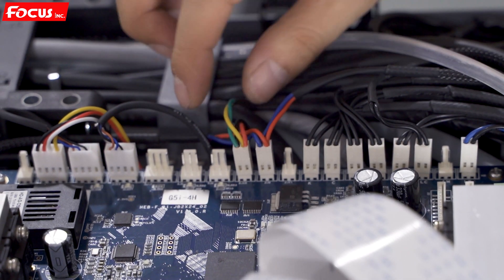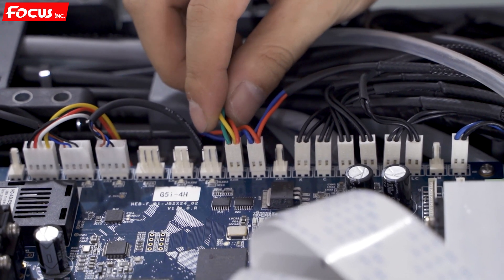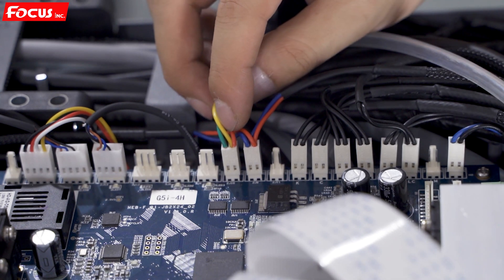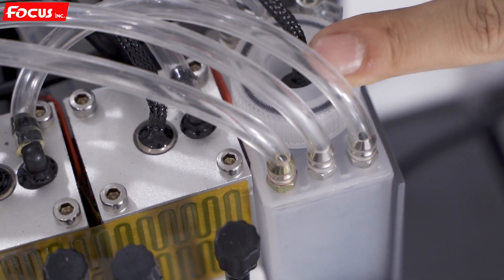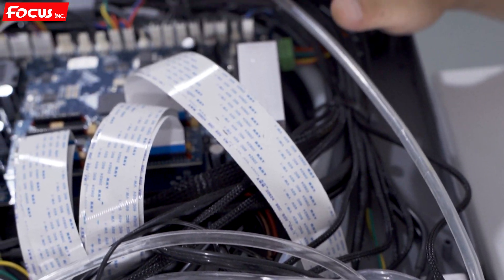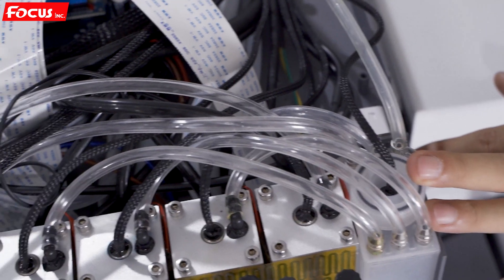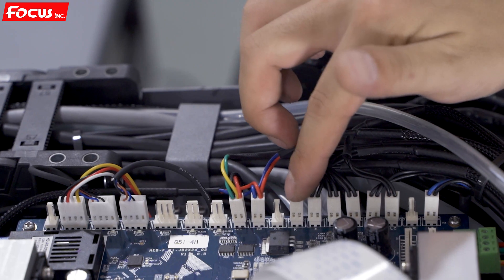This cable is for the anti-collision system to protect the carriage and print head from scratching. The signal plug for the anti-collision system is installed at the left and right side of the carriage. This pin is for the front left and right plastic air tank level sensor — used so that once ink goes back to the air tank, the air tank sends a signal to the board to stop pumping ink and pump air to protect the ink supply and air pressure system.